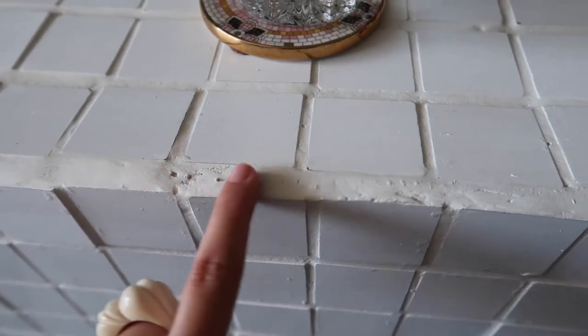Another thing: if you're cutting your tile, you're going to notice it comes with a grid. Cut closer to the tile so that the little grid spikes don't come out — the grout can sometimes sit lower than those little pieces so they'll come poking out. Also, when you're adding the adhesive, make sure it's a pretty thin layer — not too much — because if you put too much, your tile is going to come out wobbly and inconsistent. Some tiles will be deeper and some will stick out more, so the depths will be off. Try to keep it all the same and keep the tiles as straight as possible.